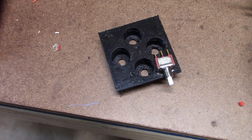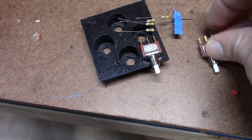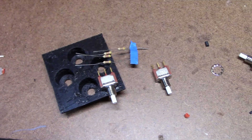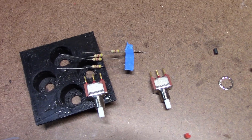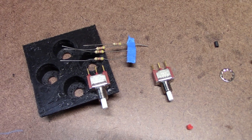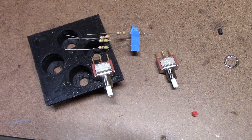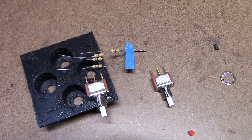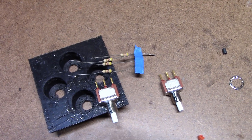We're going to put a resistor between normally open and common, and do this with two buttons in a row. You'll end up with a voltage divider — a positive wire on one end, a negative wire on the other end, and the signal wire coming off the middle. With neither button depressed and resistors of equal value, the signal wire gets half the voltage. Pressing one or the other button shorts out that resistor, setting the voltage to either the negative or positive value.